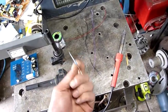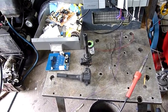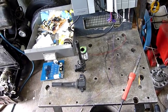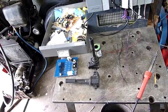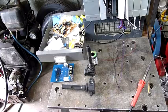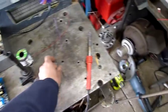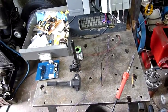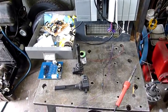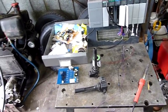Trigger. I think these resistors are too high, but I'm going to find a 4.7 or 5k quarter watt resistor. YouTuber Haxby2007 — I think that was his name — he works for the physics department at La Trobe Uni, I think. I sent him one of these and he did a bit of working out and came up with a resistance value to trigger it and a suitable power supply. So we'll give it a go. I know I'll be able to reproduce what I did at work — I just thought I'd show you how to do it. It's a very crude driver — incredibly crude — but it does work.